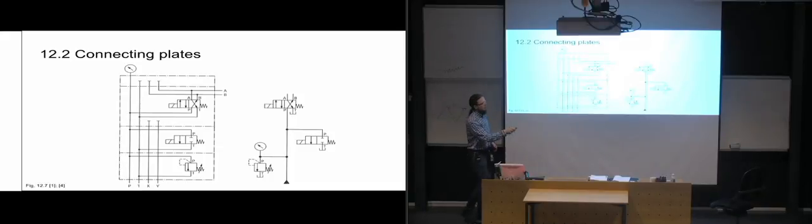So most likely there is a double acting cylinder connected up here, and if you push the cylinder all the way out, then the pump is going to just push against the end of the cylinder, and it's not getting anywhere. And if this is a situation that you're going to have for quite some while, you would want to activate this one so that you would allow pressure to move back into the tank. Especially if you know that it's going to be half an hour before you can start running the cylinder again, it's nice to have an option of recirculating it.